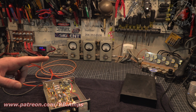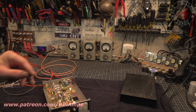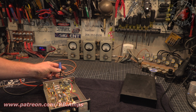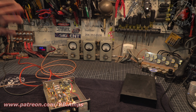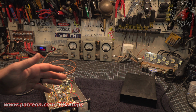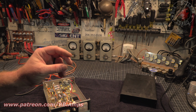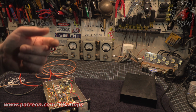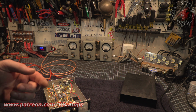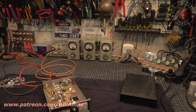Never would I ever. Repeat it with me: I will never use twist locks in my 12 volt DC install in my vehicle. It's okay for short-term emergency use, but do not make it a permanent thing. If you do, we'll make fun of you when you get to heaven because your car burned under you. We'll all point and laugh.